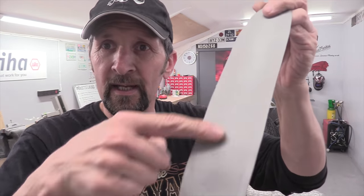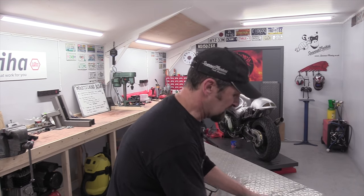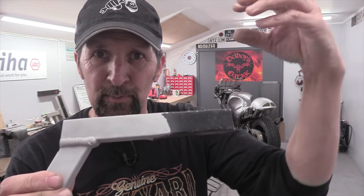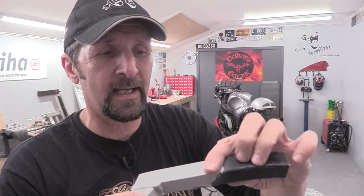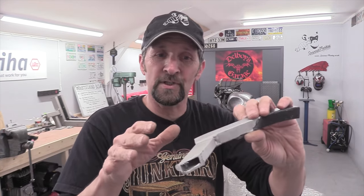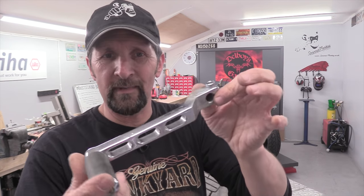By way of a verdict — this is the first bit, rusty old piece of mild steel. A couple of seconds later: silky, lovely. I'm amazed at the smoothness. I would have thought it would come out with an etched, peppered finish from sandblasting, but not a bit of it — absolutely silky smooth and perfect. You could put etch primer on that, top coat, boom, lovely finish. Here's a better example: that's the rusty old piece done down the middle to show the game of two halves. This piece of aluminium came up even better.